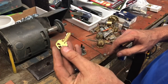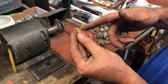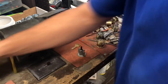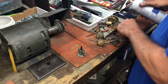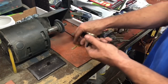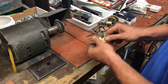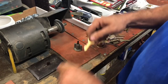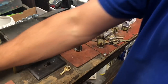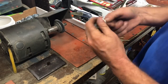I just cut this one on my 1200. It looks like 4-3-4-4-2-4-1-2. And we'll check it. It is very smooth. We can go ahead and hit this with a lubricant. I may take this one apart later to find out, but even with Kwikset single step, I hate using those 24 pins because there is such a chance that they could do what has happened here and jam up. We'll spray some lube in here and see if this helps, but I think we've gone sideways with a wafer. Yeah, that one's toast. All right, well, it served its purpose for a long while.